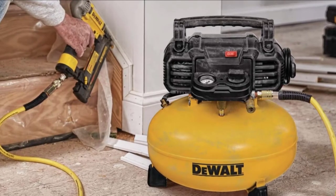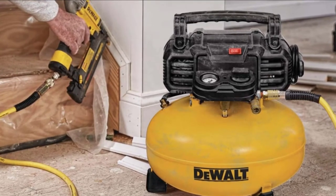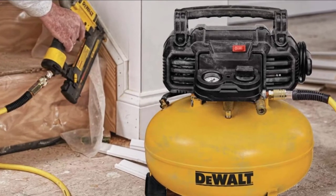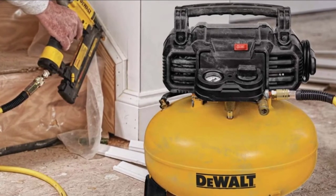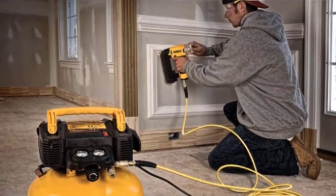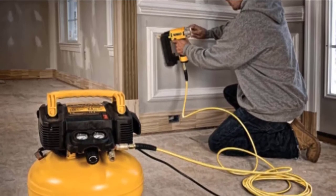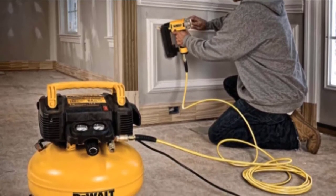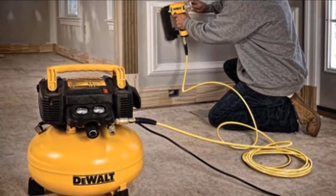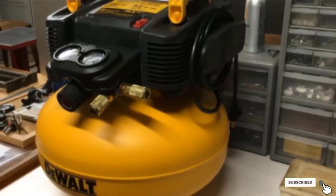Its 72 decibel low noise level makes it ideal for its size to suit environments that do not want to be disturbed with loud sound. This DEWALT is so efficient it starts easily in extremely cold weather, even with extension cord application. It runs on 120 volt, 60 hertz, 10 amp power. In order to avoid impedance of airflow, the machine needs to be situated at least 12 inches away from the wall or other hindrances, and features protective rubber legs to prevent marring. A convenient cord wrap is provided for easy and handy storage.